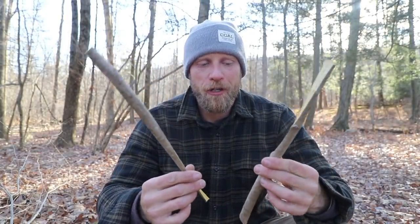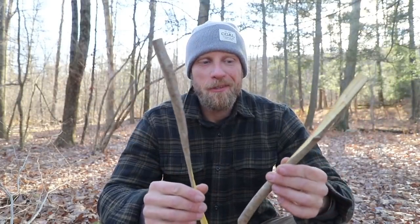Another tool for the toolbox. It's something you can utilize to help you along, but at the end of the day we are battling mother nature. In my case, this twisted piece of wood had grain that ran twisted, and although I split it out properly it still might not be perfect for the project I'm working on — I might need to scrap it. Or maybe it is fine; if it's something like a rotisserie skewer and it has some twist, who cares, it's going to work just fine. That tip is going to keep it from splitting out on one side. I learned this from an old timer I saw making a wooden hay rake — he had to split out the tines, and he said you just always go opposite the way it's running out and it's going to work perfect.